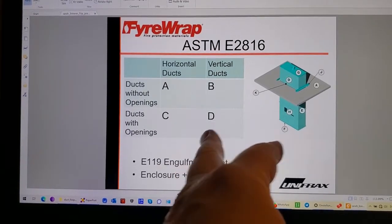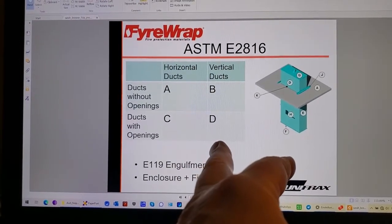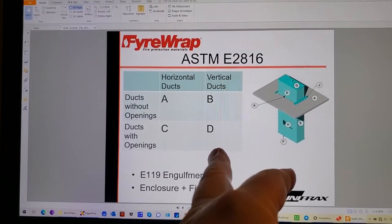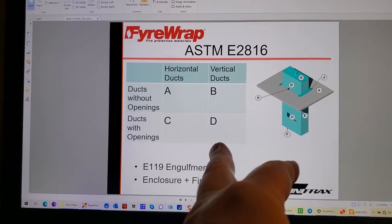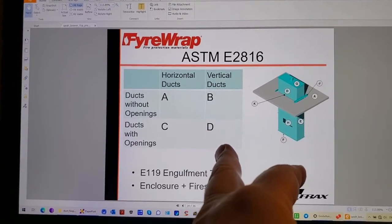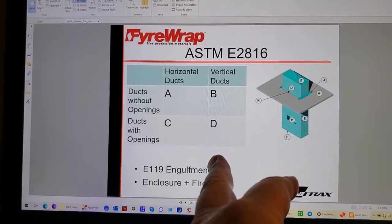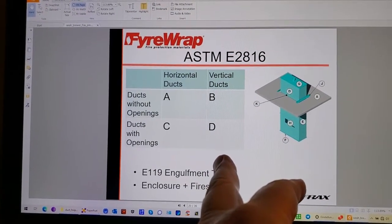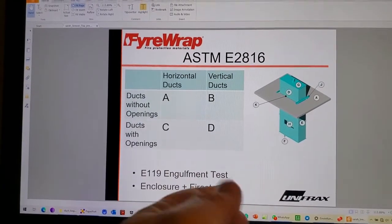So you could say, okay, well, smoke exhaust would then be for cold smoke, or at least smoke cold enough that it's not going to on its own collapse the duct, right? 'Cause it's just like 22 gauge sheet metal. It doesn't do very well in a fire unless it's been heavily fireproofed. So if you've got fire on the inside of that ductwork, what's keeping that from collapsing?